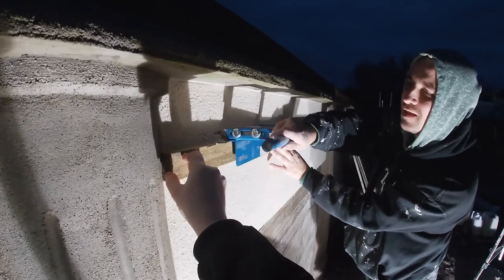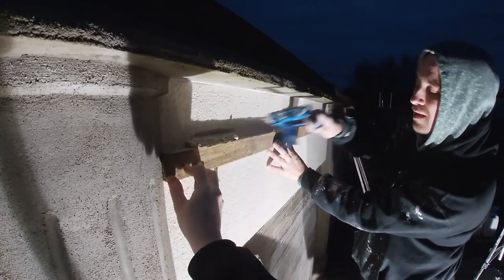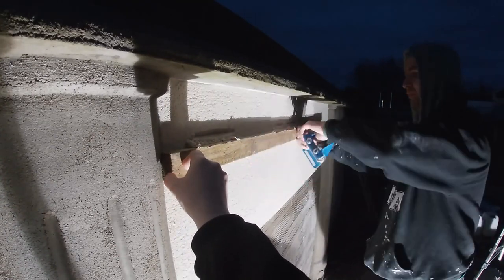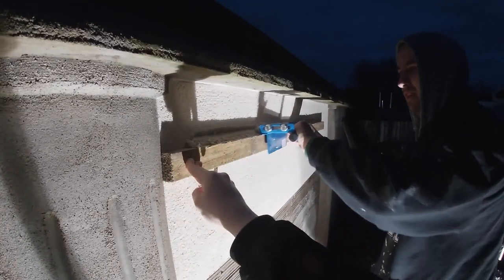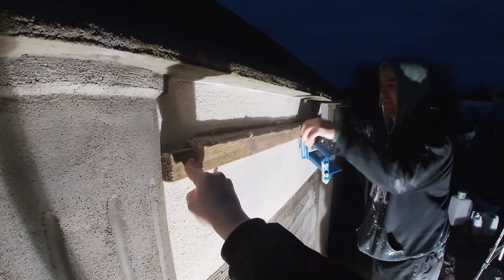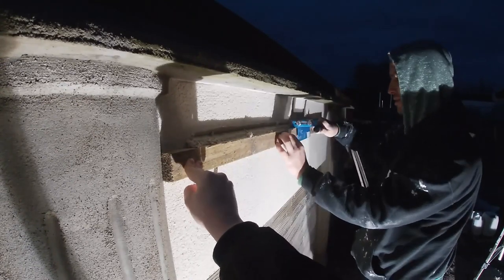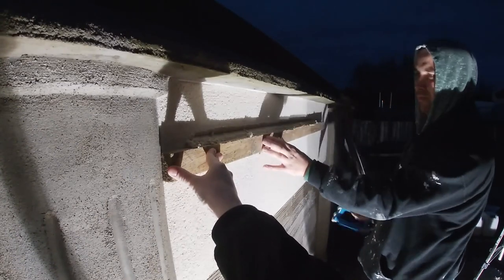So this is the Ashlar cutter tool in action. Again, I sped up this process a wee bit because I have been taking my time making sure things are straight and level before I start cutting into it, as it would be very difficult to fill a big V in that you've just cut out of the wall. So the Refina Ashlar cutter has a blade on it that you bolt in, and you can set the depth of that blade, so you go really, really deep, or you go a fine wee cut.